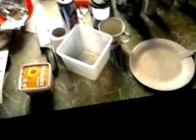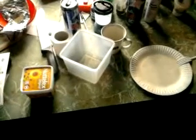because what you want to do first is stop the power coming in, then disconnect the batteries, positive first, negative next, and then put the batteries back in, negative first, positive next. That's the way I do it anyway. And then basically take your bed sheets off, because it all depends, but most charge controllers prefer the battery to be powering them before the solar panel. So if you put blankets over there, they're going to be blocked from the light reasonably well, and that's how they want you to do it.